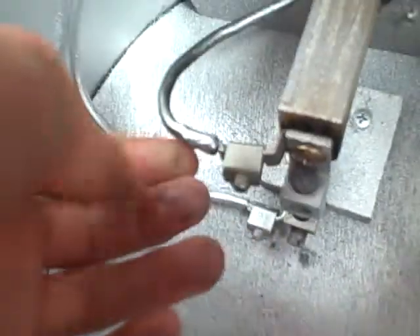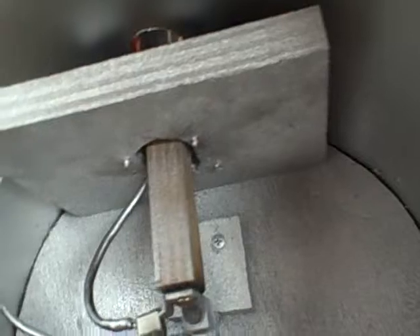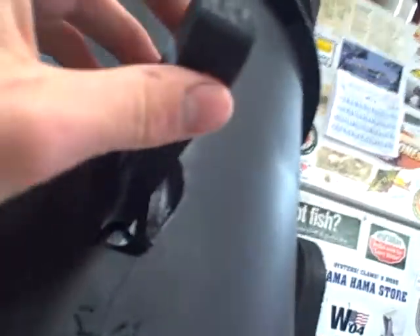Both fuses run into the lamp housing, which I've spray painted silver inside — I'm planning to add a reflector back there too. For electrode holders I have big bus connectors with set screws that tighten on the carbon electrodes. An arm pushes the two electrodes together so you can strike an arc and then feather it out. It's not motorized but it works.